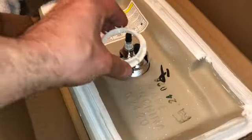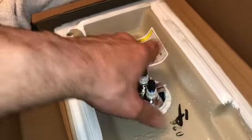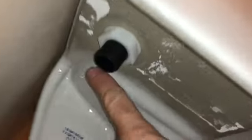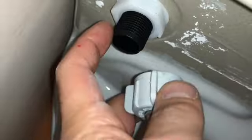Put the supply line on the bracket and hand-tighten it. Make sure the colored side is oriented correctly so it aligns accurately. You do not need thread tape on these fittings unless it's leaking, because there's a rubber gasket that presses up against the seat and seals it. Watch out — this new one actually had a rubber gasket on it already, so if I had screwed it on there would have been two gaskets causing a leak. All you should have is a plastic seat that the fitting threads onto.